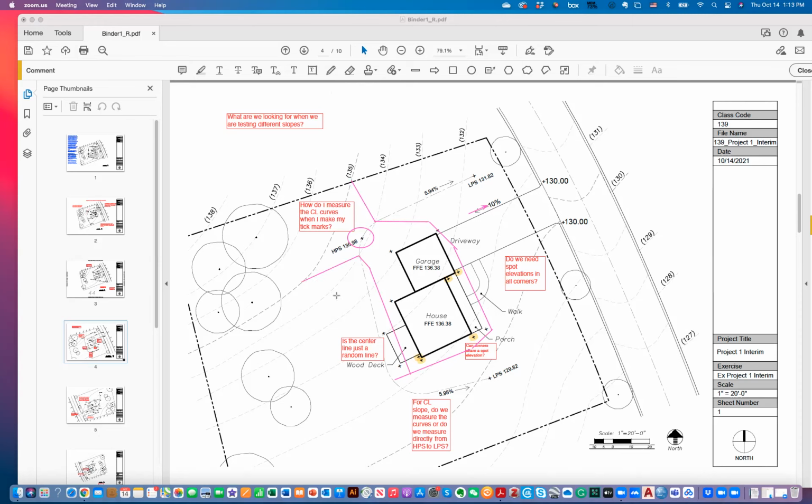My 135 is over there. So the 136 even needs to be pulled closer because now it's getting too flat. Do you see what that requires me to do for the original contours? Likely you're creating a little too much fill and elevating the house very high. If I want to draw the original elevation in cross section, you're basically creating a hill.